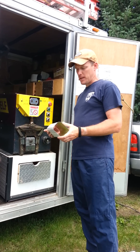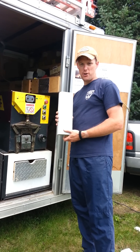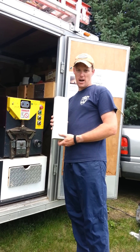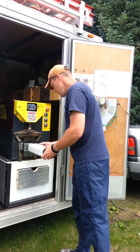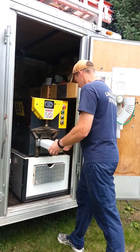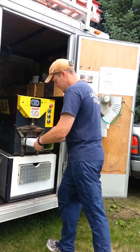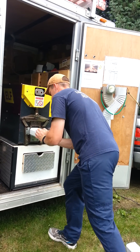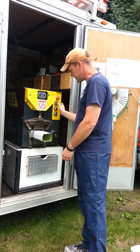This is my blank — it's a 13-inch long blank. If we bend it at 30 degrees, it'll give us an offset of an inch and a half, and I'll show you that one first. So we'll turn our selector to 30 degrees, put the blank in, and press the start button.